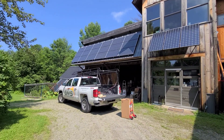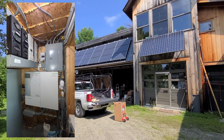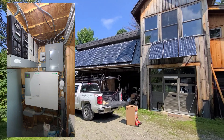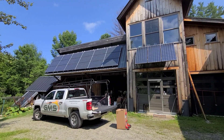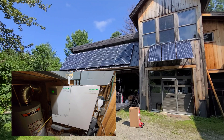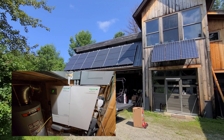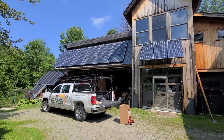This was a pretty cool system. This house was originally off-grid. I'll show you some pictures of the original system that was here. These are 210-watt Sanyo panels, and these were connected to charge controllers and then going to a Schneider Xantrex inverter system that was then selling back to the grid — kind of inefficiently done.